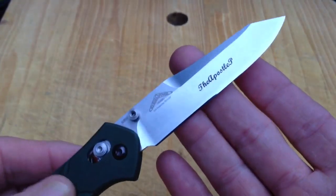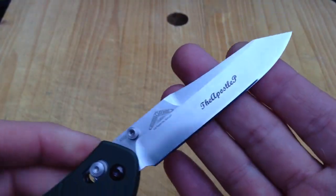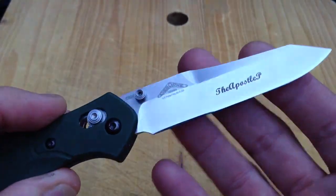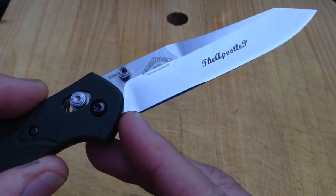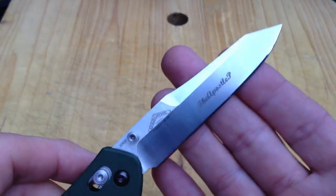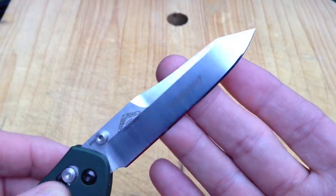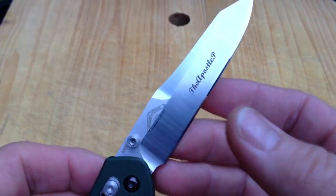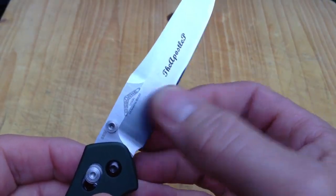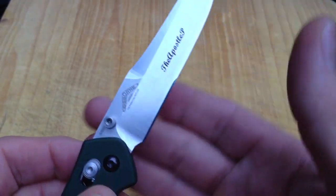So they did. But not only did they replace it — I had them handpick the blade they could find with the tightest plunge grind radius, so I'd have the least work to do in that area of the knife. And because the 940 is a notoriously poor cutter, I had them handpick the blade with the thinnest edge profile — the thinnest primary bevel behind the edge that they could find. And, boy, did they.